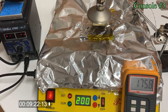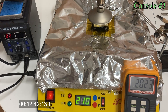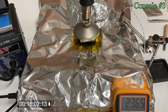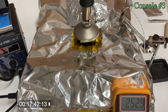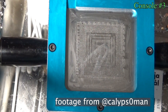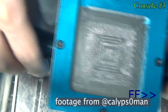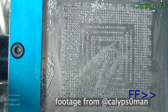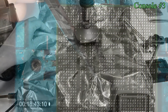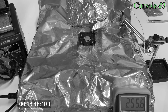After pre-baking, I confidently proceed to the desoldering. I'm so excited about having my first Frankenstein mod. As the temperature approaches 250 degrees Celsius, I realized something — I don't have the tools for re-balling. I've been so focused on getting the desoldering right that I totally forgot there are still a few more steps to solder the 40 nanometer RSX processor back to the motherboard. So I changed my plan at the very last minute and decided to go for a reflow rather than desoldering.